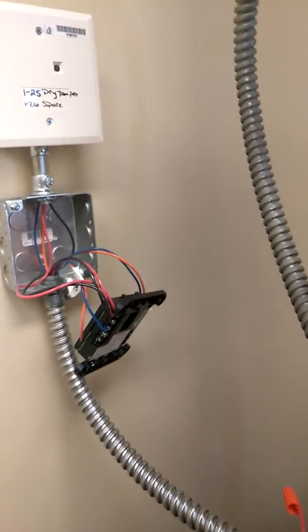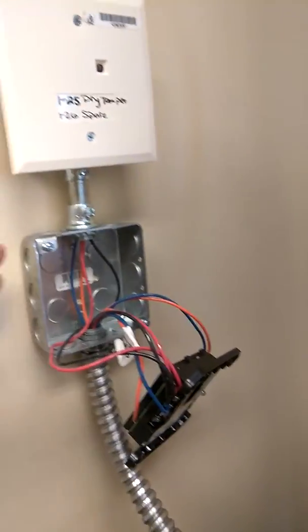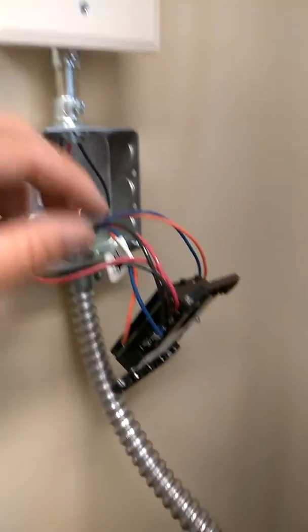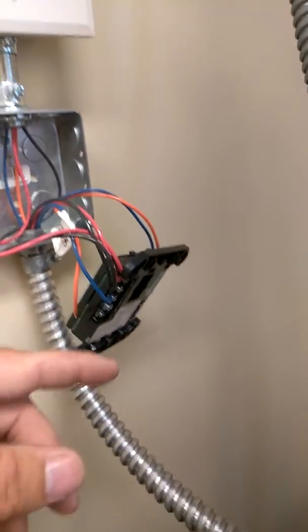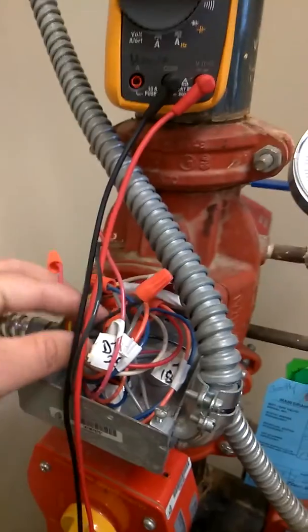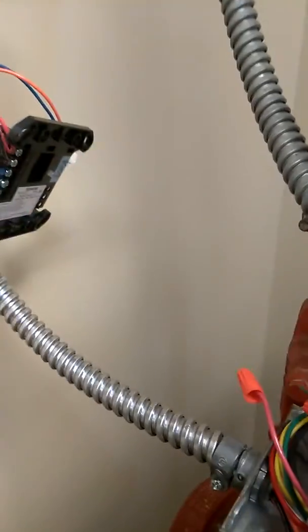Before that I called and placed it on test, of course. I came up here and looked at the wiring for this device. I disconnected both legs of the SLC loop feeding into here before I started messing with this, and I saw my ground fault go away.